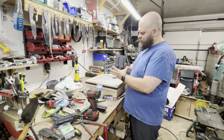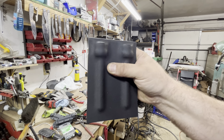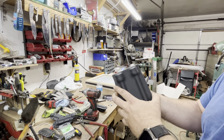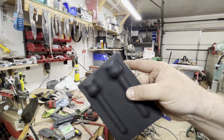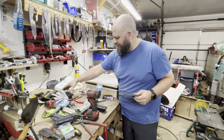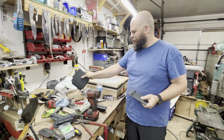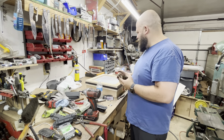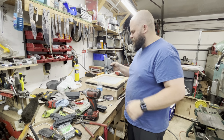And it draws that material in just enough that when I put my trim dies on there, I don't know if you guys can see this, I'm sticking out just a little bit over the edge. Now this side is not too bad. However, on this side, I've got probably over a 1/16 of an inch hanging out there. So I kind of shot myself in the foot there, trying not to waste material. I actually ended up wasting quite a bit. I cut all these blanks, about 20 of them or so, and really can't use any of them on this particular mold because it draws too much in here on the bottom, and I'm not going to be able to trim any excess off there.